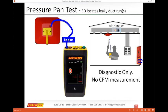Someone says they use Corey Breed's vent caps, and the pressure connection is on there during the blower door test, and is placed in various registers to use as a whole flow test. When you really understand the pressures of the gauge and reference versus input, there's a whole lot of things you actually can do and fully understand.